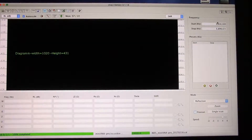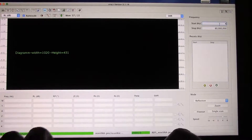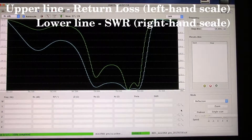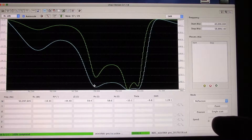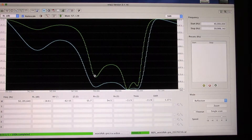One of the big tests here is with this setup — I'm going to check the SWR with my Mini VNA Pro. Right around the SSB portion we see an SWR of around 1.3. There's a bump in the middle which we saw in the models, and then it drops back down at the higher frequencies. Pretty sharp cutoff there. When I set this up, I shortened every element by one inch on each side — a full total of two inches — to account for all the other factors not in the modeling. That basically gets me pretty much exactly where I want to be.